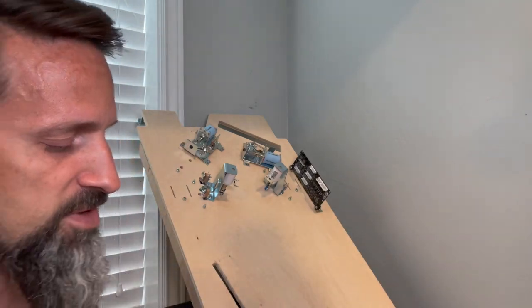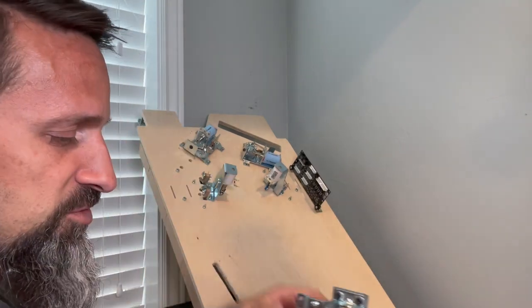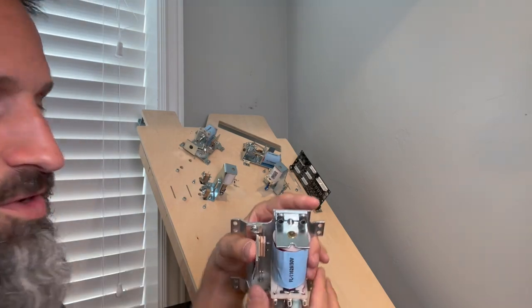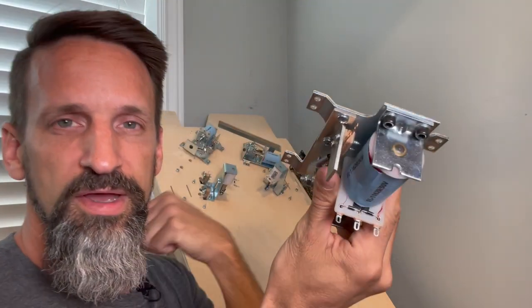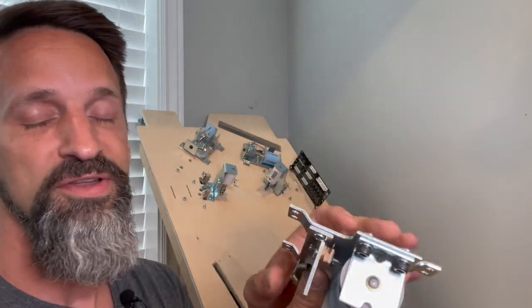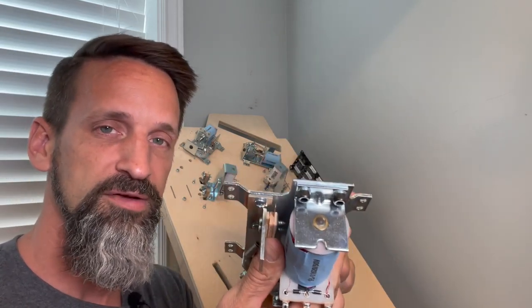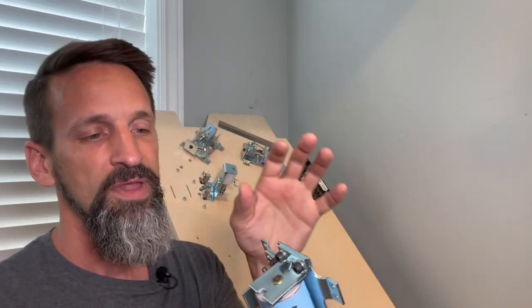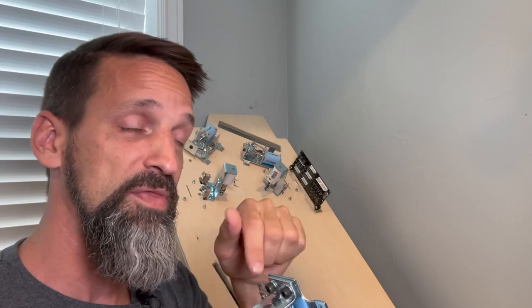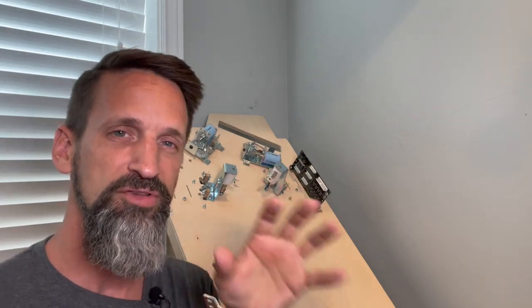Okay, so on coils, and we had this in the overview, not sure how much you remember that if you've seen the overview video, but if not, go watch that. So when you look at these coils, the flipper coils are typically called dual wound. What that means is there's 2 sets of copper wire spinning around here to create the electromagnetic force. And the bigger, thicker wire is your pulse power, and then there's a thinner wire around the outside also, that's the hold power, it doesn't create as strong of a force.